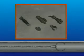The 1¼ side cutter blade is a good finishing tool. It's used to scrape the walls of the pipe for a more thorough cleaning job. Start with the smaller cutters. Then change to the larger cutters after you've gotten the water flowing.